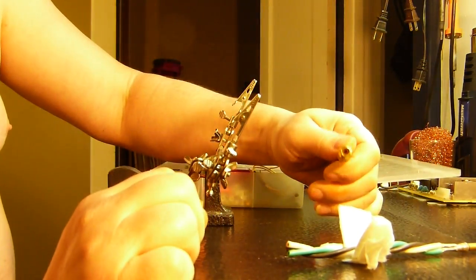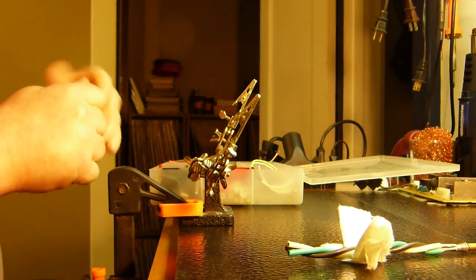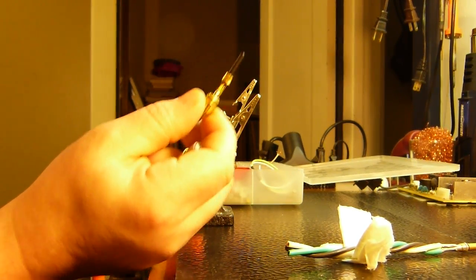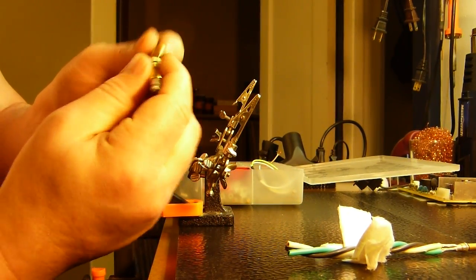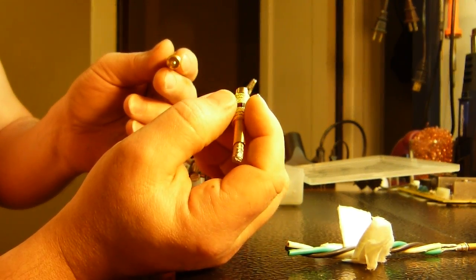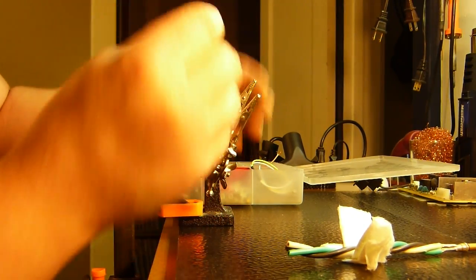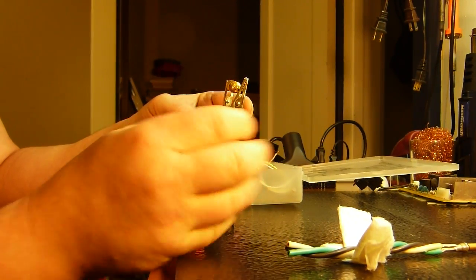Here. RCAs, I use this. See? Let's say you're soldering something like an RCA. Hey, look at this. I soldered that 20 years ago. Look at that. Still clean. Silver. Well, what you do is you just put that in. What that does is it's a heat sink. And it keeps your center pin aligned when you're soldering. See? And then you can hold it. And whatever your wire, set it up. Get it perfect. Tighten up all your things. Boom. Solder it. It's not going to move. Then when you're done, your pin's nicely done.